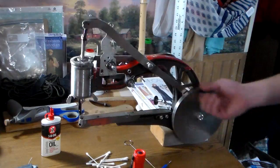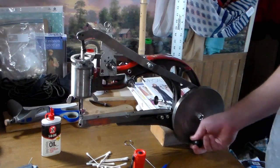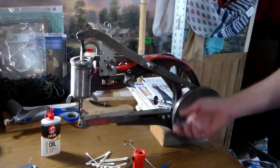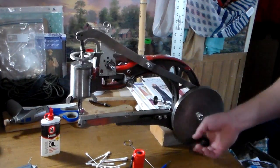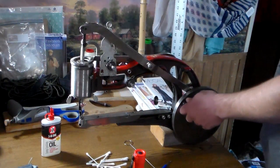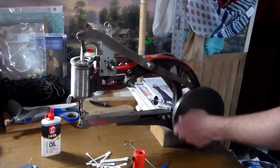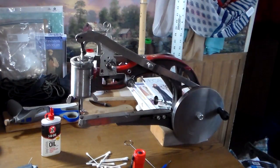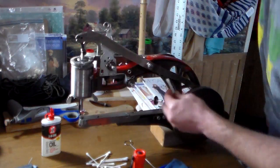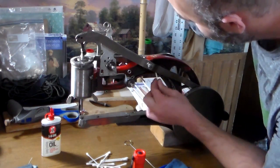And like I said, that squeak will work itself out by the time we get done working all that oil through the points. And what this is doing is it's allowing the oil to get in there, to penetrate, and it's also cleaning out the parts while we're doing this. So that's why I really wasn't too particular about wiping the machine down as I was oiling, because I'm going to come back after I'm done rotating the machine and wipe all of those points down. So it's just a good idea, like I said, to have an oil cloth, a few Q-tips, to get up under here and wipe off any excess oil coming off your rocker arm.